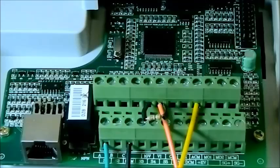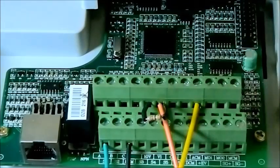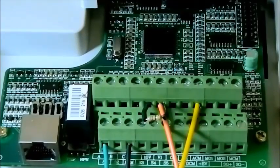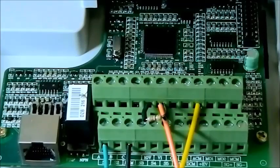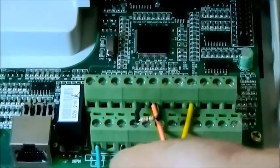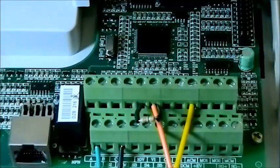This is the wiring for control. The wiring for control uses four cables. We chose green, black, orange and yellow. This cable is connected to the breakout board. The green color we connect to S1, which is for controlling the forward — it controls the startup of the spindle, to spin or also to stop. The black color goes to COM, which is the common digital signal and common for the forward control.